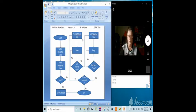Now, on our chip, we're going to have a pin, usually a general purpose input output, a GPIO. There are other assignments of pins. There's analog. There's all sorts of different assignments you can make to pins. We're just going to use a GPIO pin, and we're going to send a high signal out. And then we're going to go to sleep because we don't need to do anything else until we hit the end of our active duty cycle. So until the end of that, we're going to keep that in sleep mode.